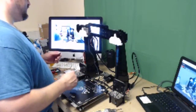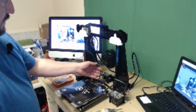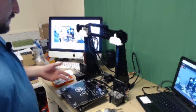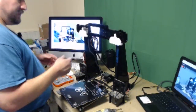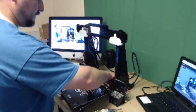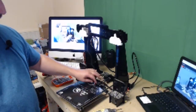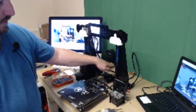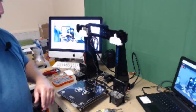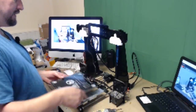90 degrees counterclockwise and cable chain installed. Yes, I have also seen that. I opted not to do that, and the reason is because I rigged this up so there was enough tension that it wasn't hitting anything. If you're still running the stock coupler, then yeah. But right here, this is the problem. If you can see it, it's the motor on the y-axis. This is what the pins are hitting. So when it's riding back, it was hitting this and coming up. So every time it was doing that, it was moving these wires around. As soon as I direct soldered this, it stopped doing it. So however you want to do it, but this is how I did it.